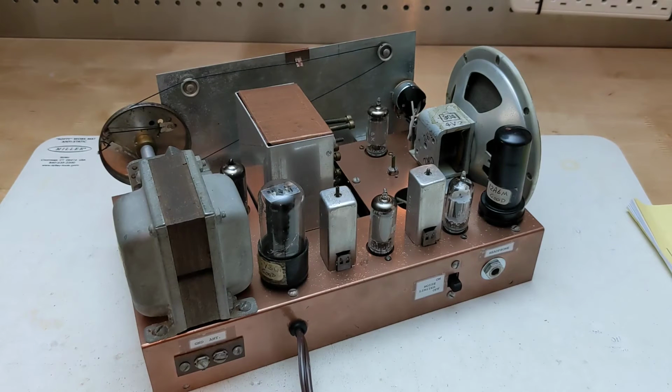The radio is a pretty standard superhet design. The power supply uses a transformer, and a 5Y3 tube is used as a full-wave rectifier with an RC filter to generate high voltage of about 300 volts. The tubes have 12.6-volt filaments powered by another winding on the transformer, except for the 5Y3, which is a 5-volt filament with its own winding.